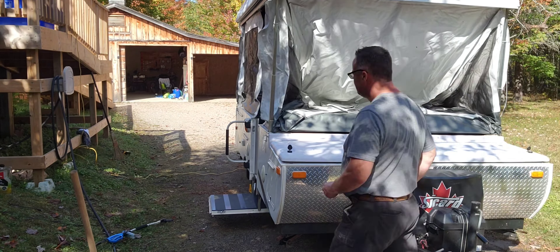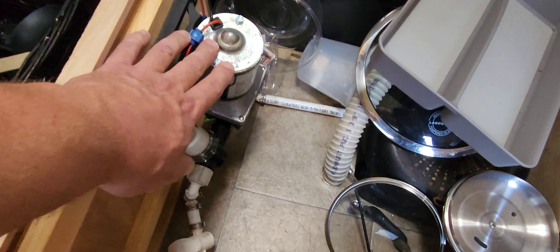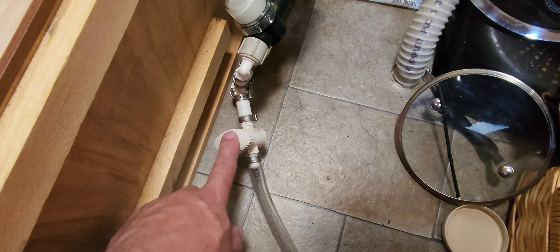You've got to get underneath this cabinet — that's where I keep all my pots and pans, and that's the water pump there. You'll see a valve like this with a long tube. You can open that up and you've got to close this other valve off — this leads to the holding tank, so you're going to shut that. Then we're going to get our RV plumbing fluid. I've got my plumbing fluid here — this is RV plumbing fluid. I only have half a jug because one four-liter jug is enough to do two years. On a tent trailer you only need about half a jug. Just put the hose in the jug, turn on the pump, and it'll suck up the plumbing fluid into the hose and into the rest of the system.